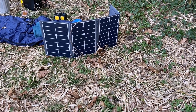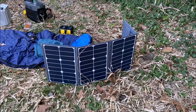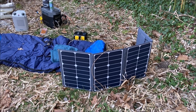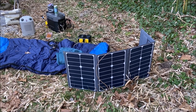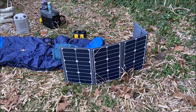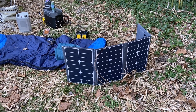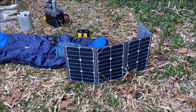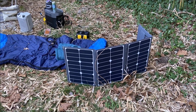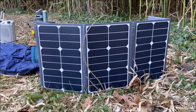Another way to get power to this unit to charge it, especially when you're out camping like we are today, is through solar panels. I have some universal solar panels here, but the unit's going to come with MC4 to XT60 connectors via the input. Any solar panels that you buy made for these power units should have the right connections or a universal kit to do that. With really bright sun, probably in the summer, it takes about four hours to charge this fully. But on days like this in the Northeast, it's going to take a lot longer. We're getting some charge from it right now.